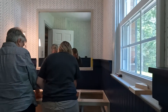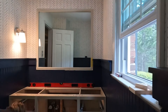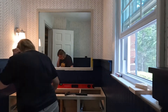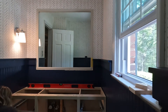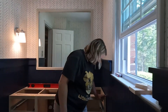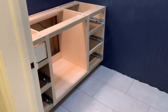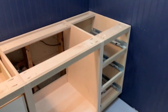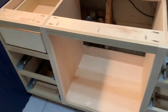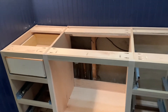With most of the legwork done for the drawers, I decided it was time to get the bathroom vanity in place. Once I had it in position, I placed a few shims under it to make sure it was completely level. From there I worked on getting it painted and finish making the drawer fronts. I didn't film making the drawer fronts, but I have another video on my channel all about how I make shaker style cabinet doors — it's pretty much the same exact process, just on a smaller scale.